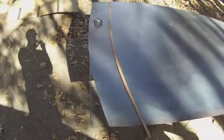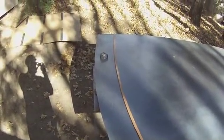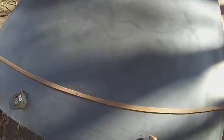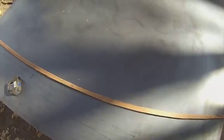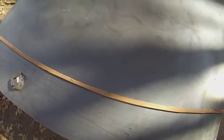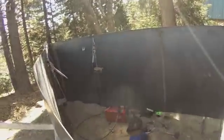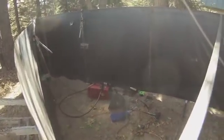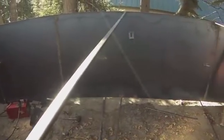I've begun to draw out the cuts needed for the ribs. This will save me half the cuts I would normally need to make because each one will count as the outside edge of the other. I need a total of 60 — I've already got three in there — and I'm going to put one every foot along the vertical surfaces of the boat.